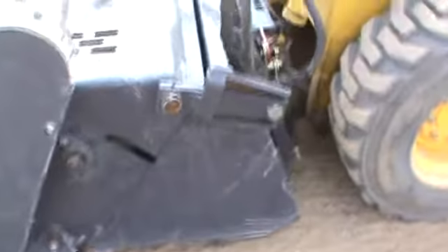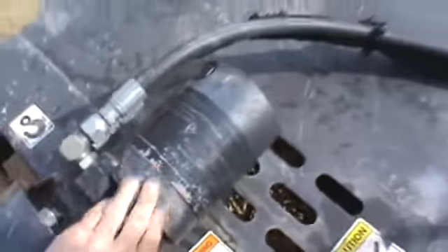This thing is not welded or busted in any way, not cracked. It's just been weathered a little bit from sitting. The drum is in absolutely perfect condition — there are a couple of little bent teeth, which is normal. Over here on this side it's very, very nice. This is your hydraulic drive motor here — no leaks or any problems.